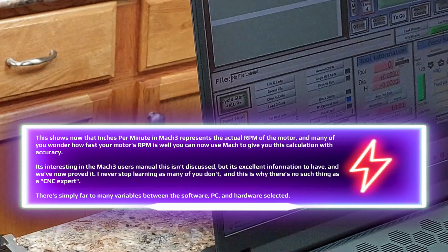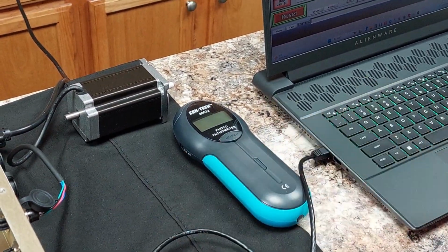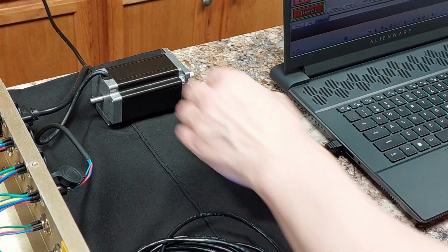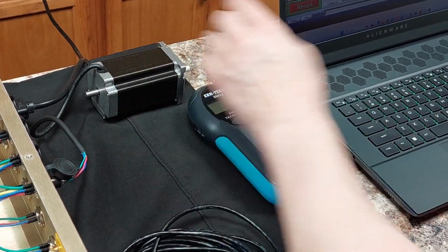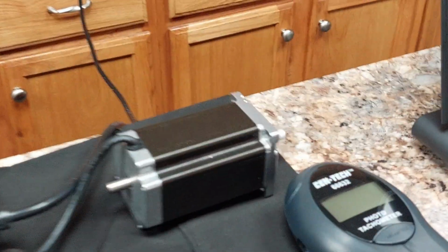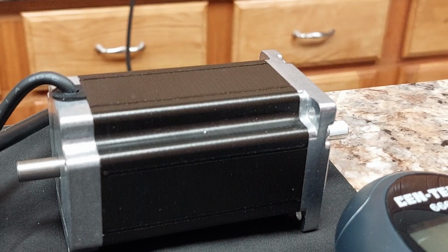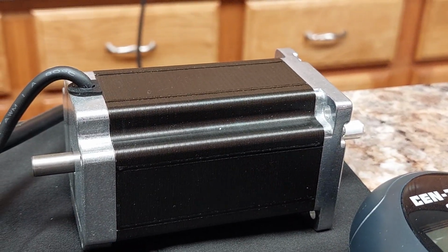You hear the motor turn off, and that's due to the fact that the drive, once again, detects that the motor is not in motion. It's just providing holding torque. It reduces current power, and it's working in silent mode, and you can hear that. Or I should say, you can't hear that. She gets closer to the motor. There you go. So let's see what this can do.